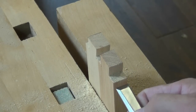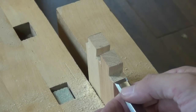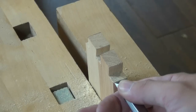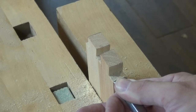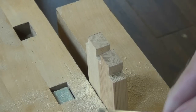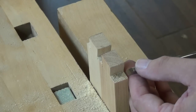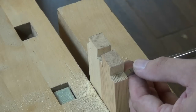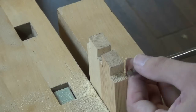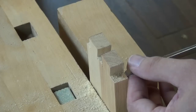With a chisel, just less than the width of your piece of work, pare down the very last bit of that cut you made by putting your chisel into the knife line and pushing in. Taking a chisel just a little bit less than the gap at the base and outside of the tails, find the knife line and push in. That will get you a very crisp joint.